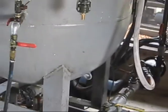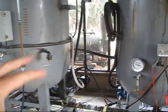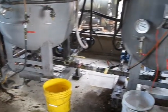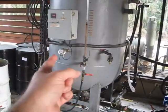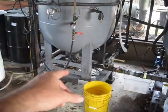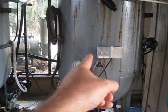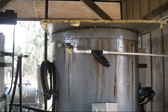We're not going through all where the pipes are and stuff — suffice it to say it's fully automated, to the extent that you have to open valves. But you don't have to physically move oil around or anything — it's all done by pumps and it's metered. This is the reactor. And then after it's reacted and done the preliminary separation, the glycerin comes out the bottom and the good oil comes up and goes into the wash and dry tank. I'll get up there with the stepladder and give folks a view down inside of it.